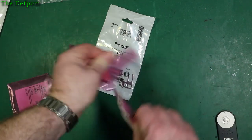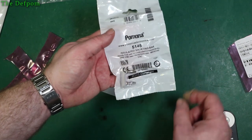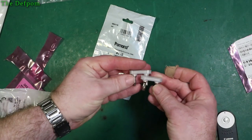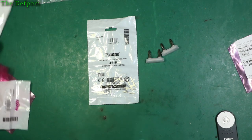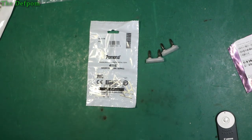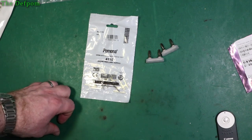I think this is something else — there won't be links for these below because these are just Element 14, so look up the parts. It's another Pomona 5145, so I did buy two of those — two exactly the same. I'm sure I bought one which is stacking as well, so I could stack them. I've got these various things for doing testing because of my need to do precision measurements and calibration work on calibrators — AC and DC calibrators. I need to be able to link the guard terminals properly, and before I had multiple cables linking together which wasn't ideal, so I can now use these links directly on the binding posts.